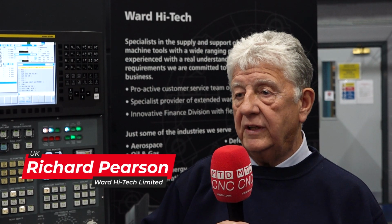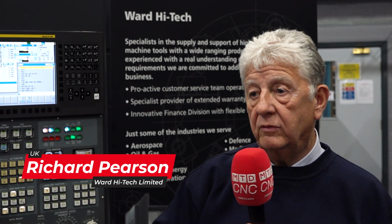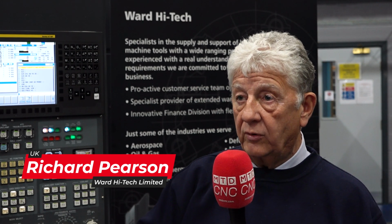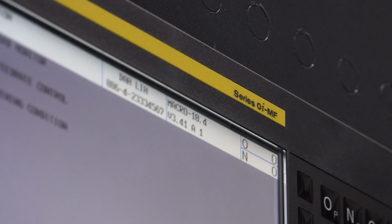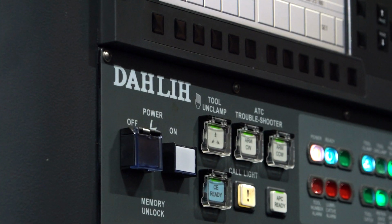Now obviously, people at home will be thinking, but what's it like to program? So what are you using to actually program this machine? Well, we've got two options. Obviously, for a lot of difficult, complex pieces, people will use offline programming. But what we recommend for a lot of parts is the standard FANUC Manual Guide i system, which is standard on this control, and is very beneficial and very easy to use.